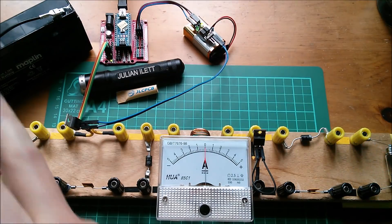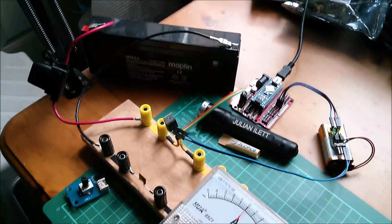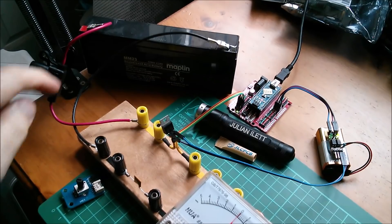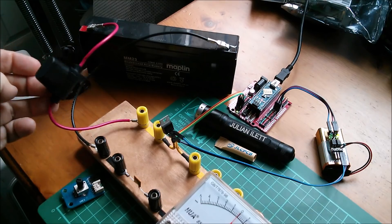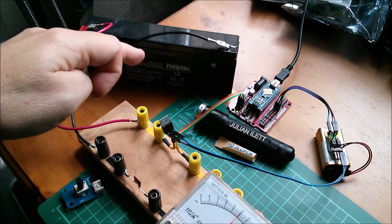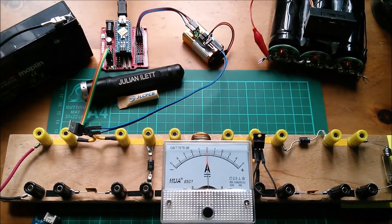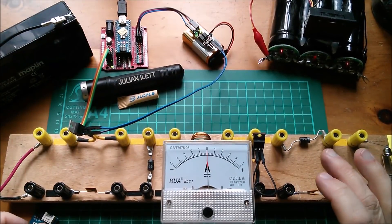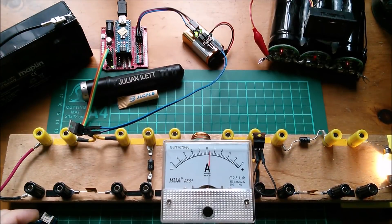This is from a lead acid battery capable of lots of amps. I've got a five amp fuse in there - one of these automotive fuses - because this could kick out 20, 30, 40, 50 amps. Of course it's not going to draw 50 amps with just a five watt light bulb on the back end. In fact we're only drawing about 200 milliamps.